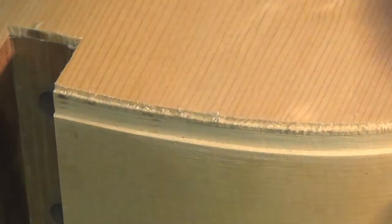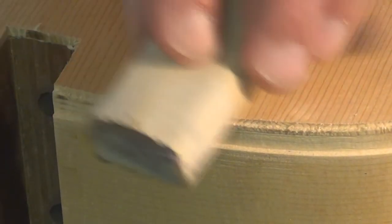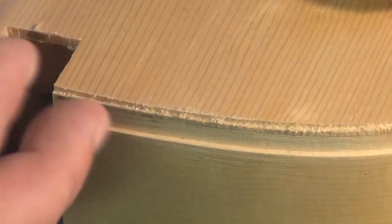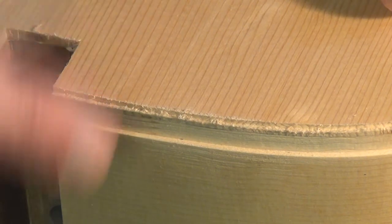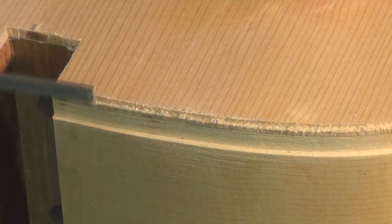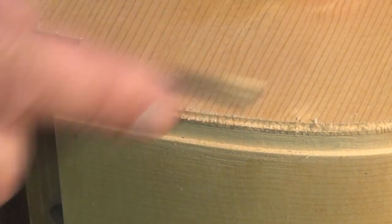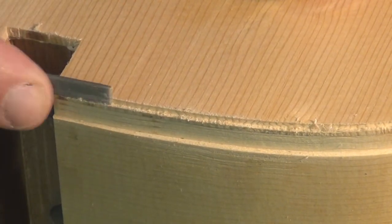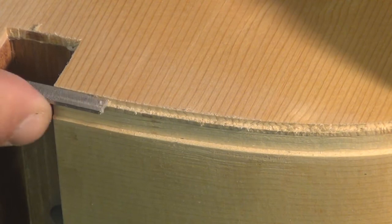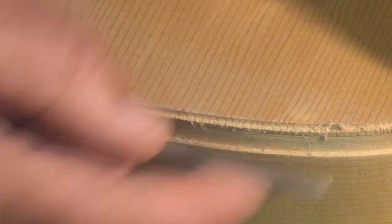In the past I've used just a little block with some sandpaper, lifted the grain up, and then pulled across this direction on the top. But some tops have very strong grain and it will tear, and I don't want that to happen. I don't think that's happening on this top, but this is a safer technique. So I'm just going to grab the file and make a pass, making sure not to roll over to the inside at all. I'm also going to level this purfling bottom — it's going to work it both directions.